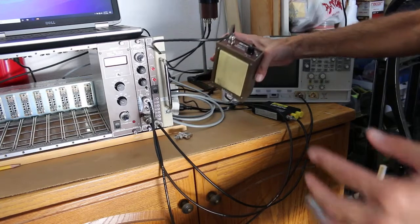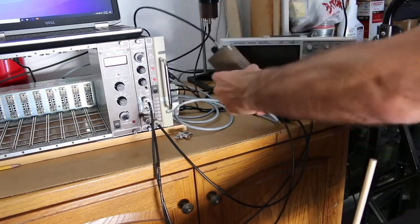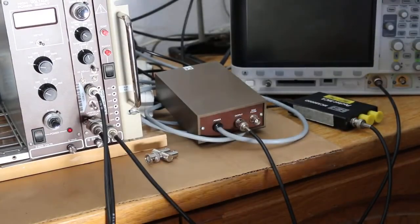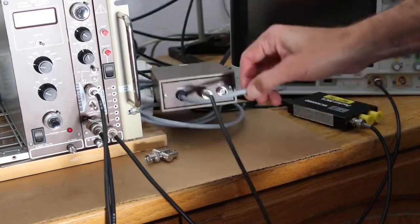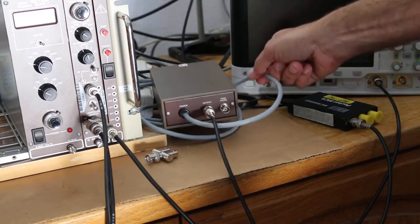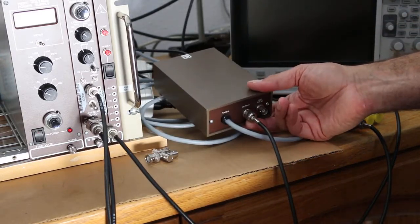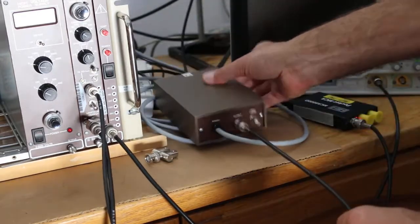So it goes into the input here. There's an input capacitor knob on here which serves as a filter. We have it set at 0 right now. And the preamplifier is especially designed to deal with these very, very, very small currents and boost them up in a successful way. So boost them up without degrading the signal or changing its character. It's just the job that this thing does. You can see it has its own power, so it is plugged in. It has to get that ability to boost signals somewhere, and the energy it boosts the signals with does come from the wall. And then, of course, there's an output on it, so the small signal directly from the detector goes in over here and comes out over here. So the preamp just sits there and does its job.